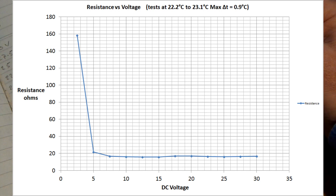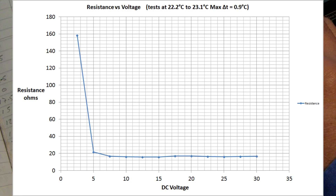The maximum temperature spread is less than 1 degree, and from the previous video you'll have seen that for every degree centigrade rise, I'm getting about half an ohm fall in resistance. I'll put this in a graph, but it looks as though that line is not quite as it appeared — that graph would not be quite the same as the first graph I showed you, where I was talking about the apparent resistance of water changing with the applied voltage.